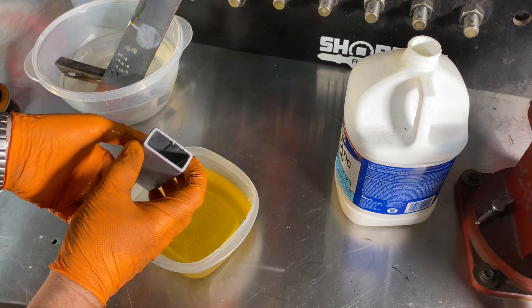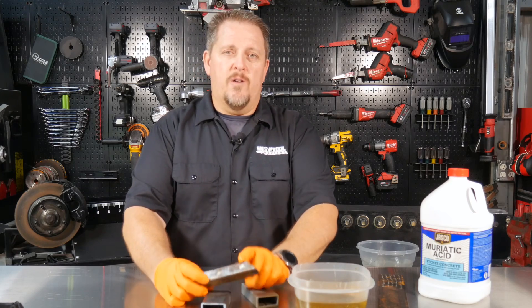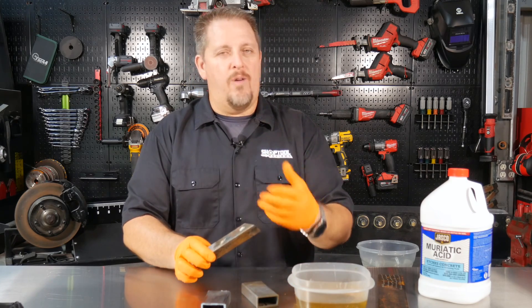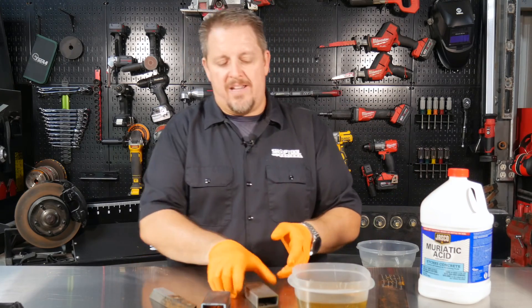Also, we could hit this really quick with some acetone and use our TIG welder. TIG welding is something you don't want to do on something where you've got mill scale and rust — it's just not as forgiving as say a MIG or a stick. So you can't do that; you've got to have nice clean metal.